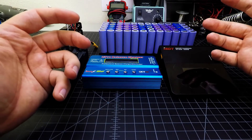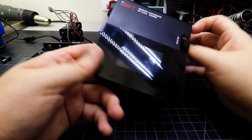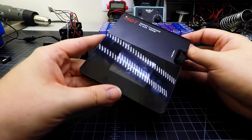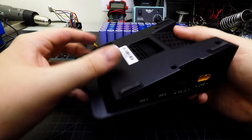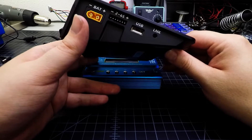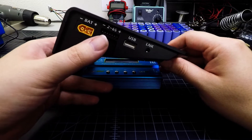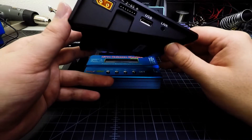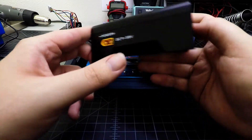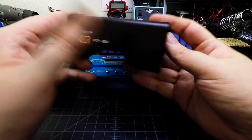For the really big project coming after this one — still a portable powerwall but not exactly mini — I picked up this 500-watt charger from ISDT. It will put out much more current intended to charge larger battery packs much faster. It still charges 2 to 6S cells, it's a lithium polymer charger common in the RC industry, and it uses XT60 connectors directly on it for DC power.